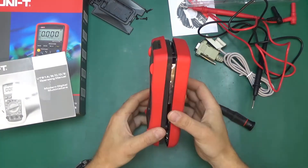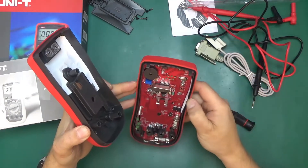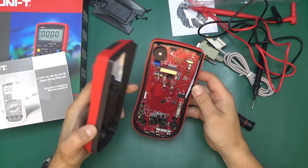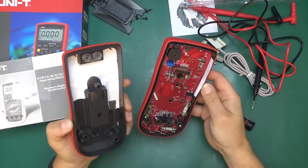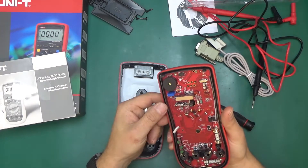And here we are. Let's have a look at how wide this lip here is — this is really good. It's a really good design feature: if this meter were to fail catastrophically and explode, this is far better at containing the explosion inside because it has got that channel around and a big lip that overlaps. ABS plastic mould, rubber overmoulding, and a diode that sends information out in the form of light pulses.